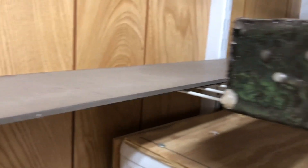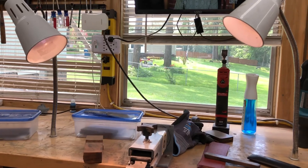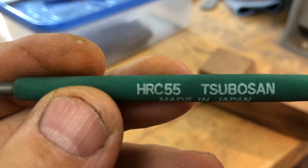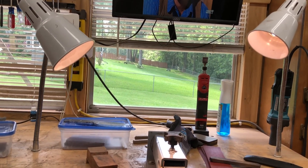Finally got some eighth-inch in — that took forever. It's the same steel you would make any knife out of, whether you make it Purdy or not. It's heat treated and tempered to the exact same hardness specifications. Here's my hardness tester — that's 55. Anything above 55 for a using bushcraft or hunting knife is more than adequate. If you want harder than that, you're gonna have to use stainless.